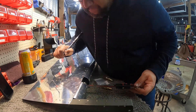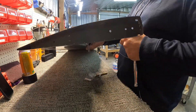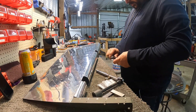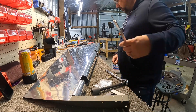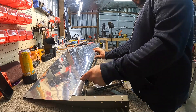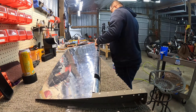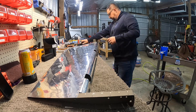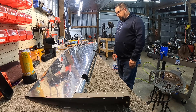Now I've got my 3D printed bearing tool out again and I am setting the height on all of those bearings. Each one has its own height — it's referenced on the plans, and you just measure from the spar to the center of the hole in the bearing. Eventually I'll get it hung on the vertical stab and make sure it's all straight and spins freely. They also have a jam nut on, which I'm not entirely sure why, because technically once it's in the hinge it can't spin in or out. But they provide one, so I installed one.